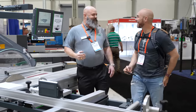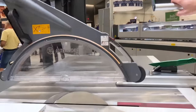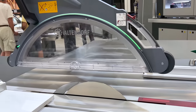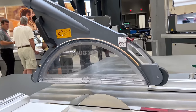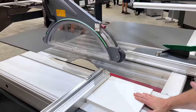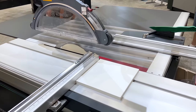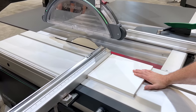But we'll get down to the nitty gritty of what you really want to see. Start the saw. Let it come up to speed. We have an LED feedback light. That LED is telling me that the saw is on but everything is safe. As I go through here, it's green, it's yellow. Saw is spinning, it does not see a hand. It's green — it sees a hand, and it says you're safe, you're going to make the cut.